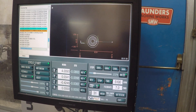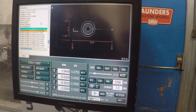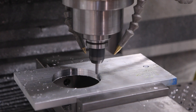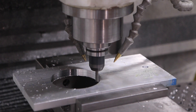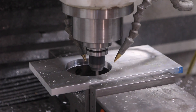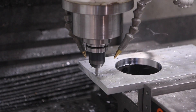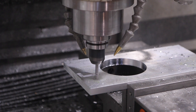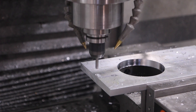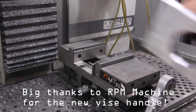I use it a ton for the step increments, for starting the program, and just the usual stuff about PathPilot — like you couldn't do in Mach — you've got the GUI, you can mess around with it, it's not going to hurt anything, you can increase this, close this, unplug a USB stick. Come back and then clean up that Sheer Hog finish. Honestly folks, it leaves a spectacularly good finish for a tool that's not intended to be any sort of a finishing tool. I ended up adding a roughing pass so that when I'm cutting the finish pass, I'm not slotting but rather only cleaning up 10 or 20 thou on that face.